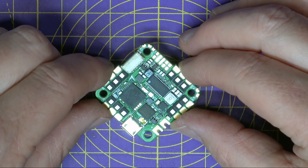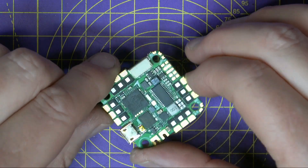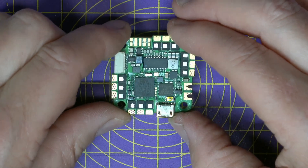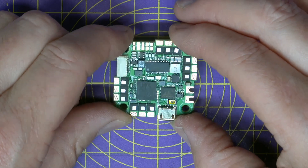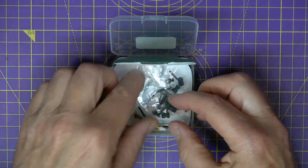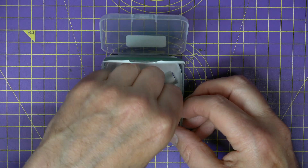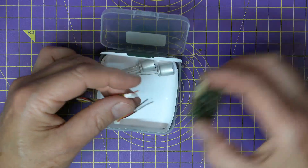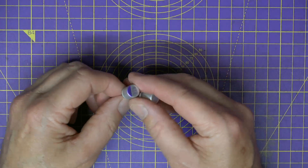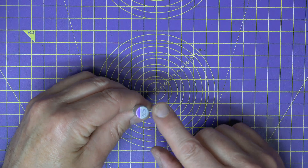It's made to be mounted like a diamond mount, which is normal for whoops and toothpicks — you can see the arrows pointing forward there. But it's easy enough to 3D print or buy a cheap mounting adapter plate to mount it square to a frame if you've got normal mounting points. In the box you get wired XT60 and XT30 battery connectors, which is a nice touch, mounting hardware including soft mounts, a couple of wired connectors for the DJI socket, and two low-ESR noise suppression capacitors — 470 microfarads, 35 volts, so they'll work for anything up to 6S.